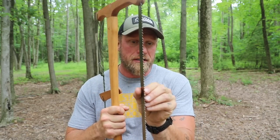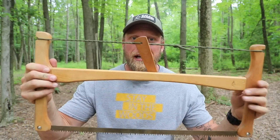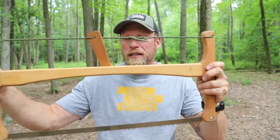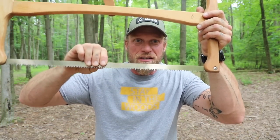So what to do — this goes for both saws. One thing that many people think is their blade is moving, so they tighten it so tight they either break the paracord or they cause damage to the saw. Bow saws on the other hand, you can only tighten them so tight — you flip up the handle and they're sort of locked into place. But these things, they still have that flex, so you're never going to totally get rid of that. Now, if the saw itself is all wobbly and not holding together nice and tight, then it's time to tighten up the windlass. But it's not going to make this stop flexing.